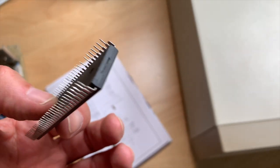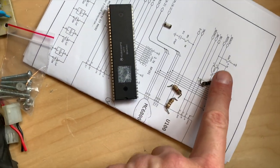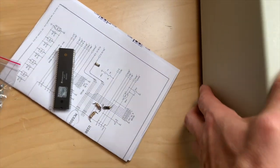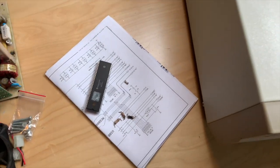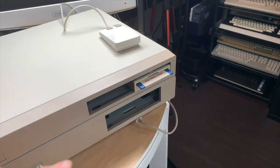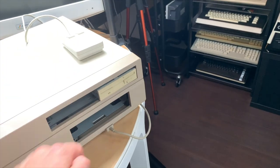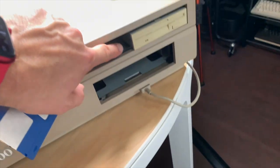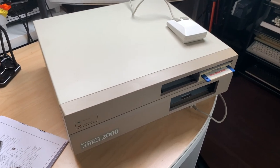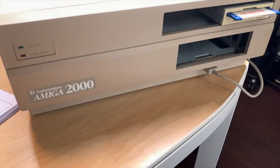I also didn't show that the CPU was a bit butchered — there were broken legs that were crammed in there, so I had to replace that too. We have those three resistors from the power supply and the fuse, which were also dead. I will of course hunt for the plastic covers to close everything nicely, and maybe I'll 3D print a new faceplate for the drive to close that gap. But for now I have a working A2000. Thanks for watching, until next time, bye.